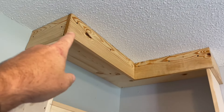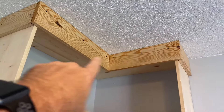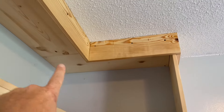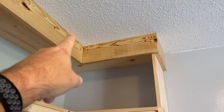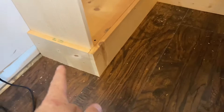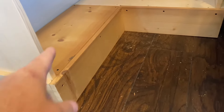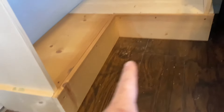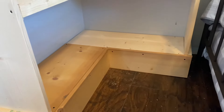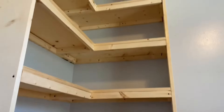I've got a few more things to do before I paint but looking good so far. Up top I took a 1x6 and trimmed it out — I'm going to go back with some painter's caulk and wood putty, sand it down, and paint that white. Up under the top I decided to put shelving board so it's a very clean look once we paint everything. Down low I took my extra shelving board, cut it down so it was level with the shelves, and I'll put some wood putty and painter's caulk on that and paint it white as well.